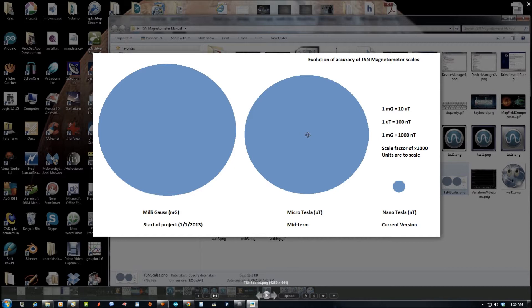There's two different forms. The 3L is the sensor that I'm using. There were some issues with the earlier sensors — these are usually used in navigation and GPS digital compasses. This graph I have up right here, the large circle on the left — these are all to scale. I'm showing the size to give you an idea of what we were able to measure then and what we're able to measure now. The sensor outputs the magnetic data on the X, Y, and Z axis in units of milligauss.